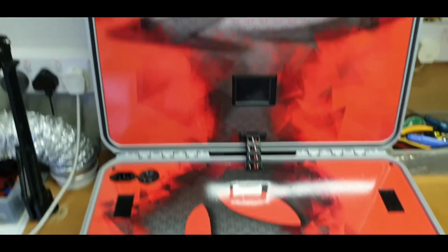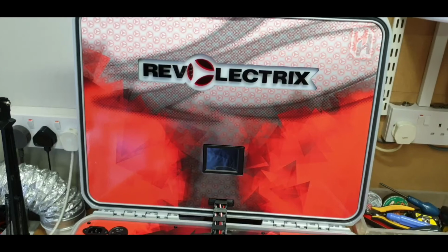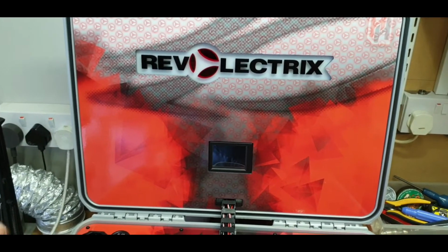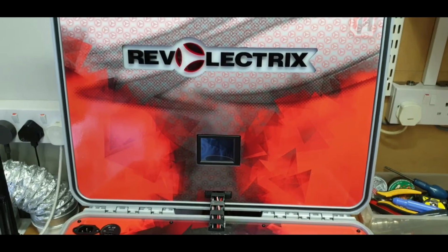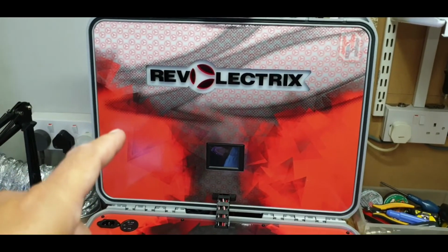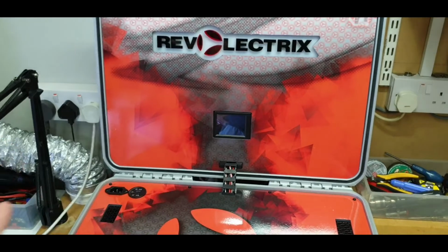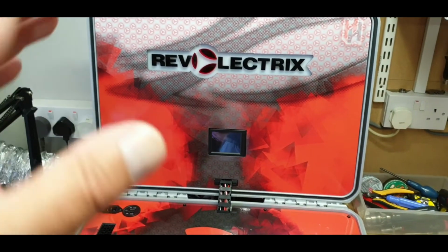The upper lid, on the other hand, I thought I would try something different, and because I had some offcuts of this material, I decided to try the wet soapy water method. So I tried it first on an offcut, applied it, squeegeed it flat, and sure enough, that was the way to do it. So I actually did the top panel wet with the soapy water technique, and that really did help, to be fair. Again, with the polypropylene, I obviously used the 3M primer on it first, let that flash off.